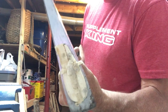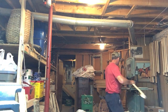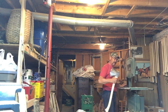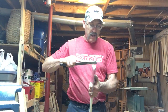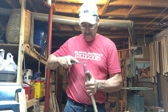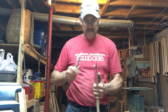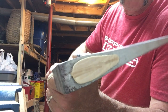So this is what it looks like — I pounded that in there as far as I can get it. Now I'm just going to take the bandsaw and cut that off nice and smooth. So now what you can do is take your file or your wood rasp and just clean up around the top of it. I usually bevel it in on the top and smooth it out around the top. Check that out — nice and full the whole way around, shaped exactly like the eye is.